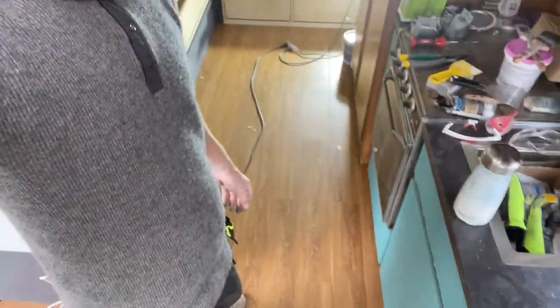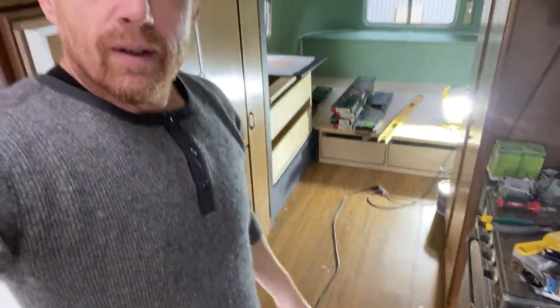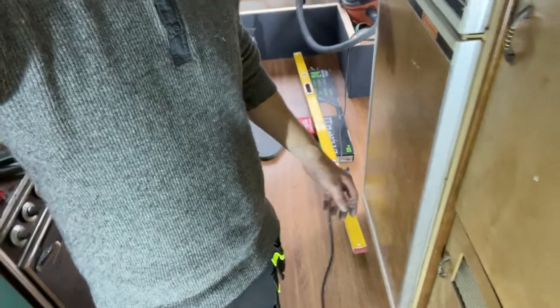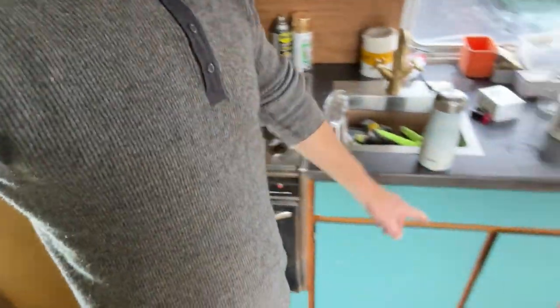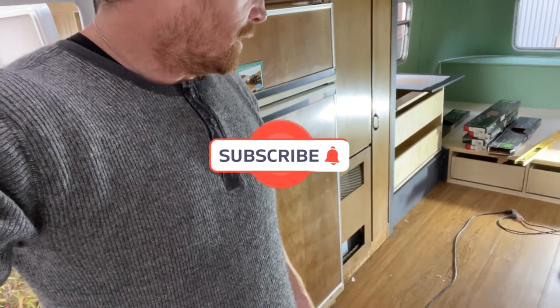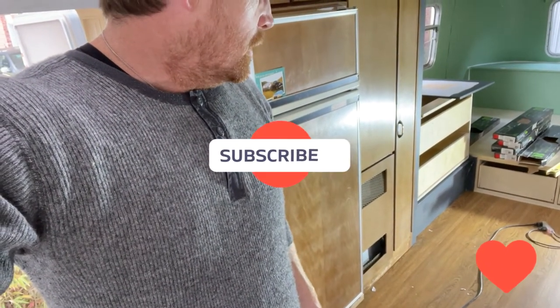Floor is done. Sticky hands — I don't see any other way of doing it. I guess you could wear latex gloves but I think that would be frustrating, especially when you're trying to kick off the plastic. I've got to use some paint thinner to get the adhesive off my hands. The color does tie in a lot with the interior and I see the logic now — it makes the space look bigger, that's for sure. I've got to do corner bead all the way around the perimeters, pre-paint that probably, and there'll be three different colors — I've got to stain some and paint some.